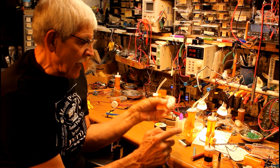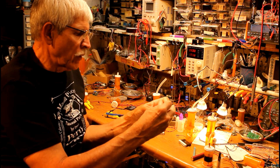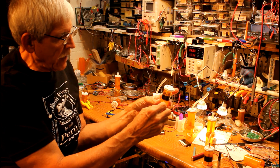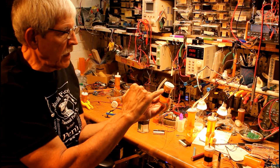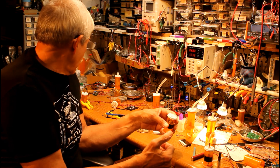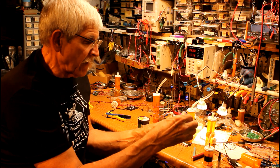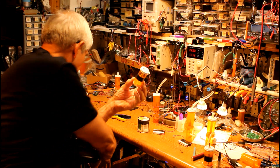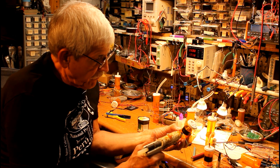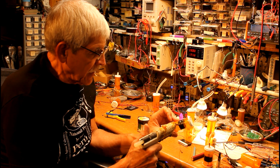Take a second cap for one of these pill bottles and put it on. Another hole you need to drill is in the second cap that goes on top of the whole unit. We wind up with a chamber down here that's going to be pressurized, wires coming out the side going to power for the heating element, and a hole at the top where air is going to be expelled along with the smoke. There's a piece of brass tubing that goes in the top, and that's where the smoke will come out. This has to be sealed up — I just use a little bit of hot melt glue. Since we're working with pretty low pressure air, it's not a big deal to get it airtight.